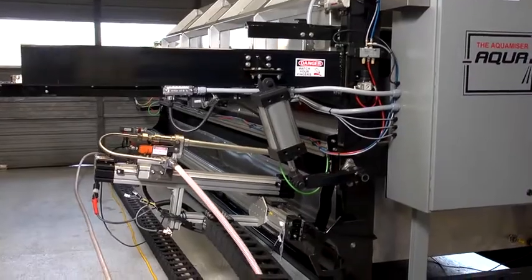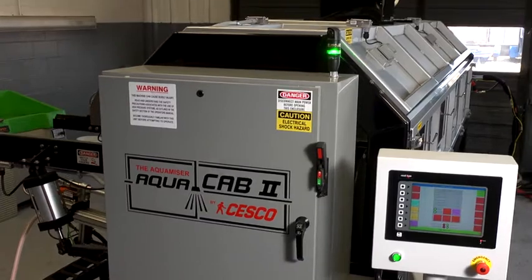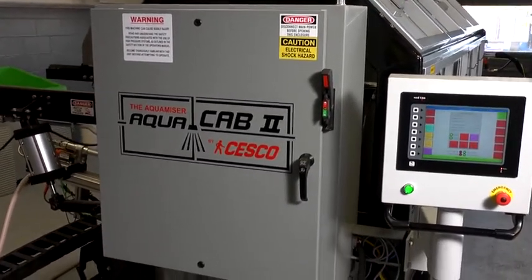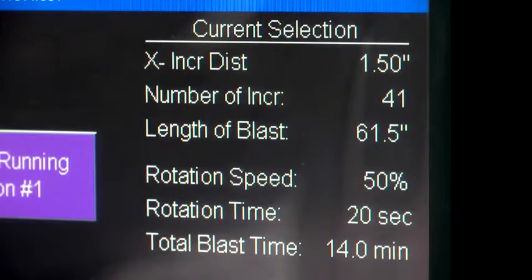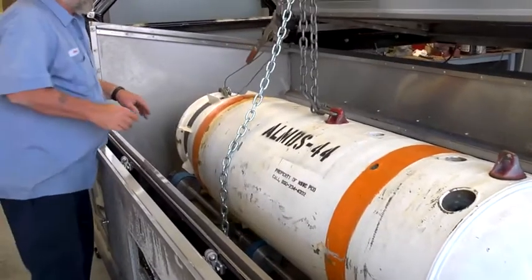The HP water is delivered to the RBB through a dual linear actuator mounted rotary head system. Once the individual shapes are programmed into the system by the use of a swivel mounted full color touch screen display, the RBB becomes a select and blast system.